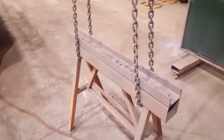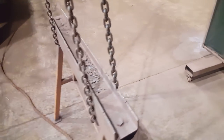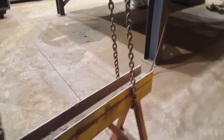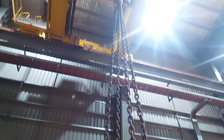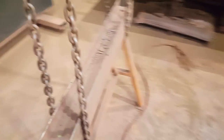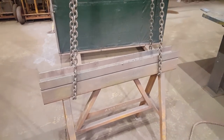Back again with the basket hitch. The reason why it's called the basket hitch is because it wraps around it like a basket — up around and over top. What's happened with the chains is the chain's gone through one side and back up to the ring, back up to the ring on the other side. So this is a classic basket hitch. If the crane driver goes, 'just basket it bro,' you can go, 'okay, I know what that means now, I'll basket it.'